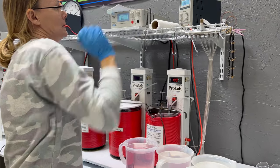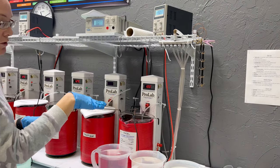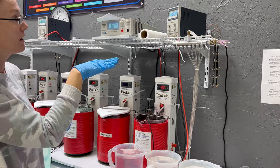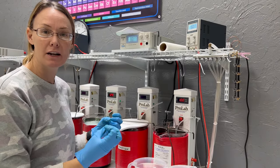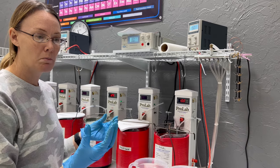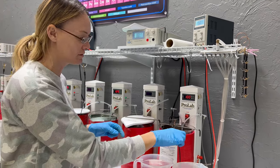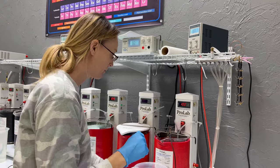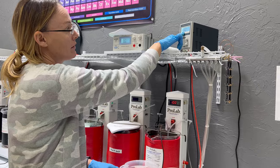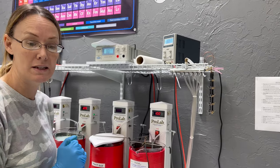It's always important to make sure your power supply is on. If your part sat in there and your gold tower is not on, or your alligator clip isn't connected, you can have darkening or almost a weird blackening of your piece. That's usually an indicator that you have something going on with your common or your power supply. Right now we're at about 9.5 amperes — everything is running well, so we'll show you the goods when it's done.